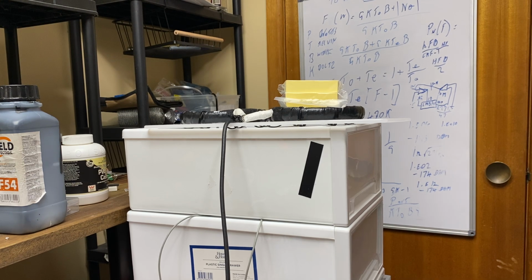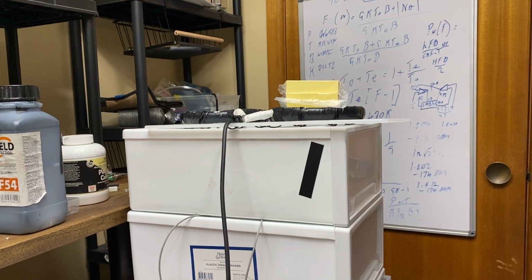And I said, actually, I really got stuck into it and said, yes, I can. So we've worked out a lot of noise issues, where the noise comes from, how it intermodulates in the detector, and basically turning a lot of coherent noise into non-coherent noise, so it doesn't stack and add or multiply.